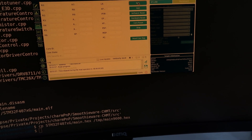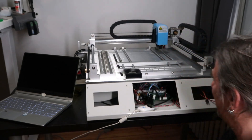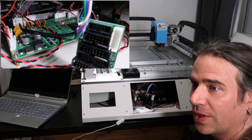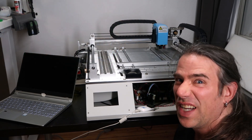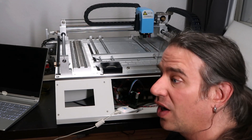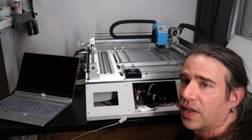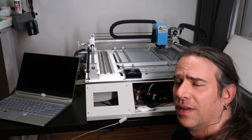So I relented and installed the heavy STM Cube thing. Even with that, the process was super messy, probably because of my screw-up. Programming would work but not get verified. Then it would work but wind up in some weird loop that did not sound good at all, spitting out garbage through the UART. So I think it's fixed — I managed to burn some firmware. Now when you turn it on, a couple of sounds but nothing crazy. There is a chance I've burned some motors, the pumps. I'm actually really worried about the pin to pull the feeds — if that was locked on for too long, it'll just burn out and I have to replace it.